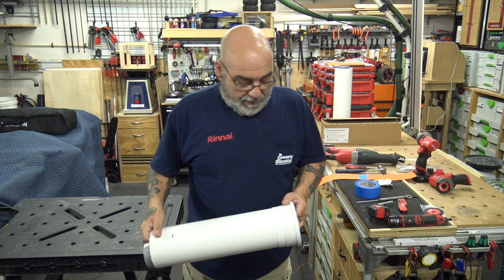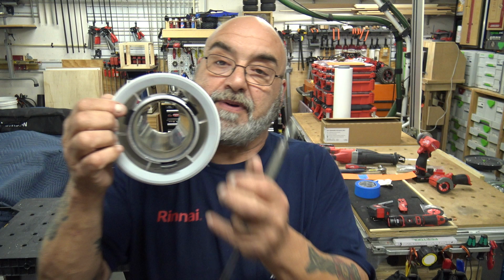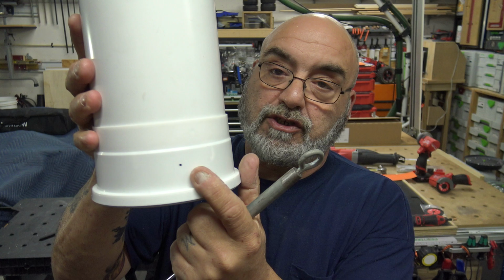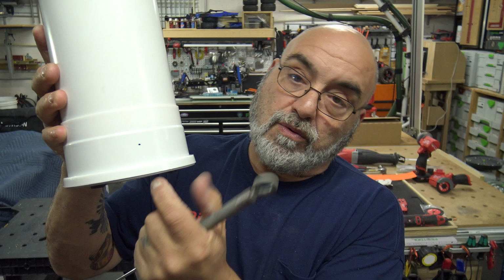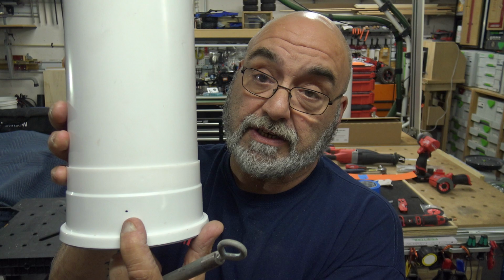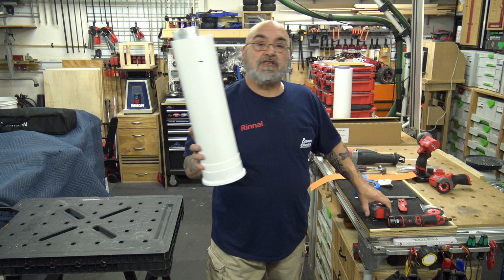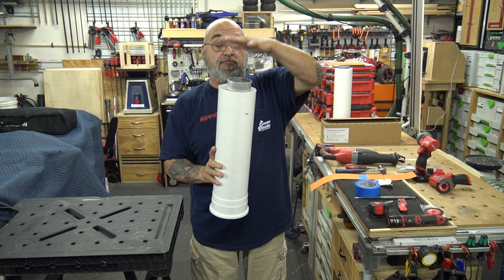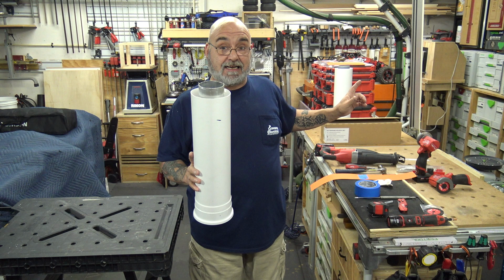Okay, so how do you cut this? All right, there is an engagement inside of the pipe. If you see these little tabs right here, there's three of them, it goes back, and I marked it here on the actual pipe. It goes back from the rubber gasket to where the white pipe engages, 1 1/4 inches. Okay? So when you're measuring, just say this was a 19-inch piece. I'm showing you with the hardest because of the metal, but this procedure is exactly the same with the plastic and whatever length, the 10, the 19, or the 39.